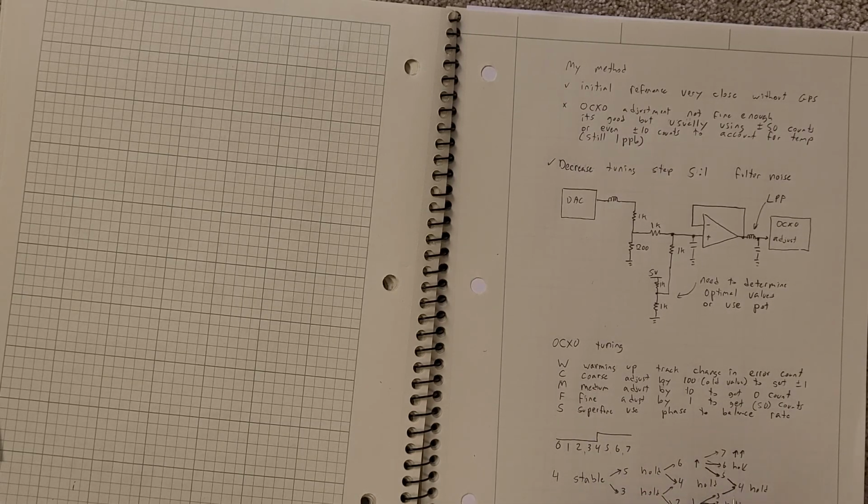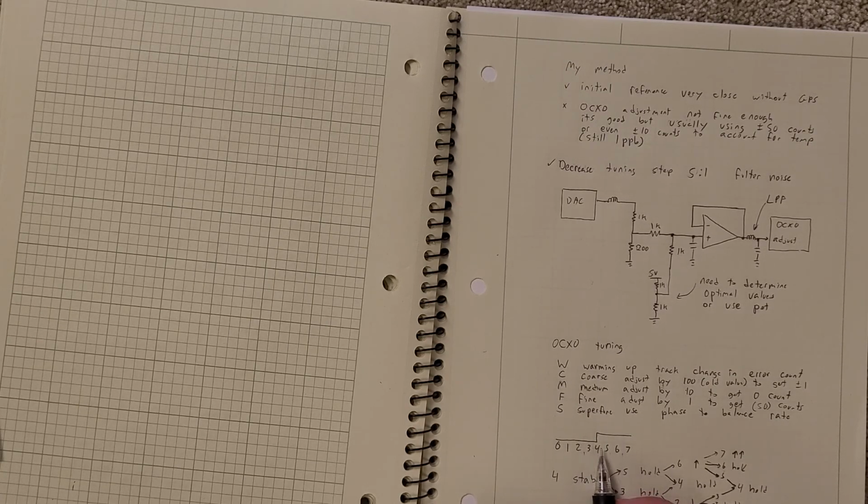And there has to be some hysteresis built in, because this does sometimes jump back and forth. Ultimately, when it's stable, sometimes it alternates between two values. You don't want to do anything until it goes, if it's going between 3 and 4, you don't want to do anything until it goes to 5. Then you send it back, and that puts some hysteresis in the system. So I've been paying attention to what I do manually. I'm going to put that into an algorithm.